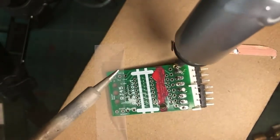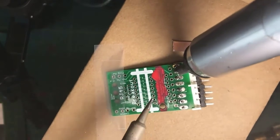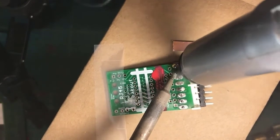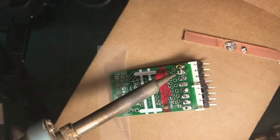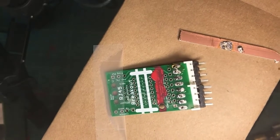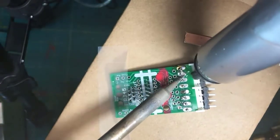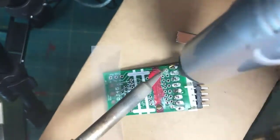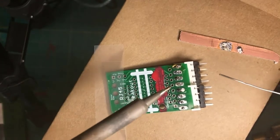This is fun. Let's see if you guys can see this. There's the Solder-Pult. There's the solder I want to remove. Melt the solder, fire the Solder-Pult, and you can notice here that there's a lot less solder. I didn't get it all in that shot because I didn't wait long enough for it all to be melted. So I re-cock the Solder-Pult, make sure all the solder is melted, boom. And that's another common way to remove excess solder from the work. Now that the excess solder is gone, I can re-solder it.